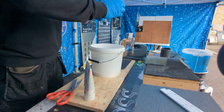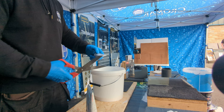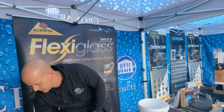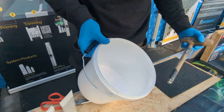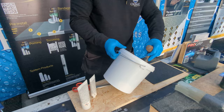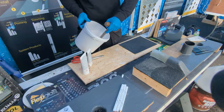These come with a nozzle — you can squeeze them in. If you're mixing up big quantities, simply snip the end off and empty it in, so it's pre-measured and you know exactly how much hardener is going in. It's a thick paste but it does dissolve easily. It does need a good mix — if you just give it a quick stir and apply, you'll have lumps and it won't go on properly. So give it a good mix. Bigger amounts on a roof, use a paddle on a drill.